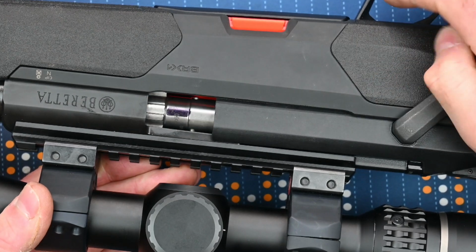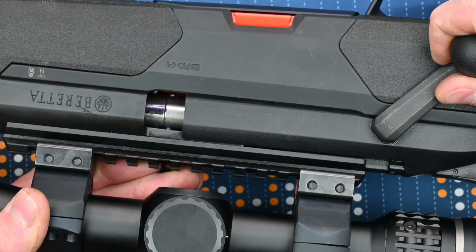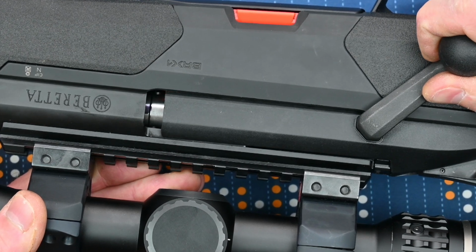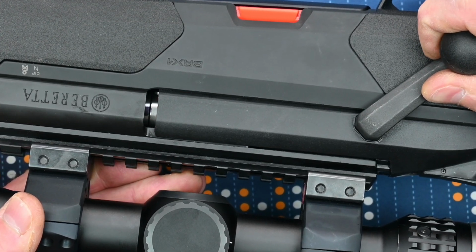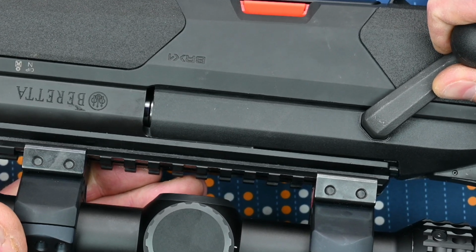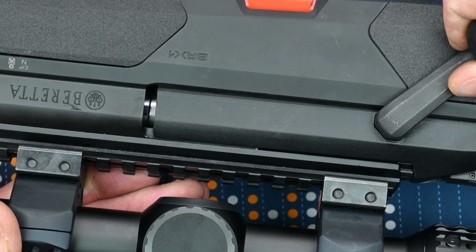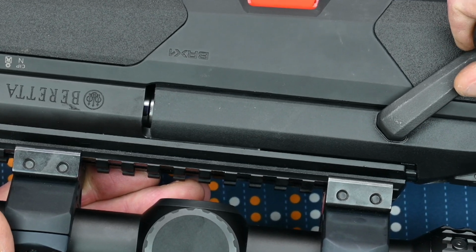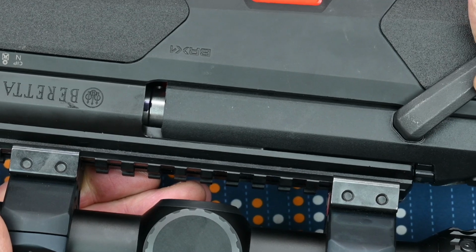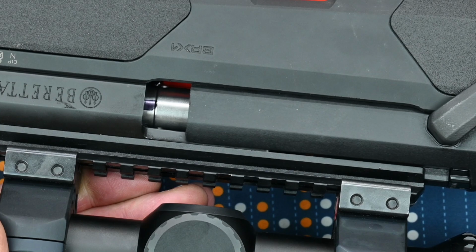Oops, that actually just flicked forward on its own. So as I go forwards there, you can possibly see the bolt will be almost closed, and it's just started to rotate now. The black mark has just started rotating. Can you see it? Just going backwards and forwards in that last sort of 8 or 9 millimeters of bolt travel. It's very, very difficult to see. But essentially that's how it works.